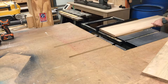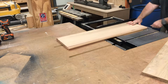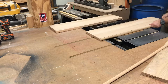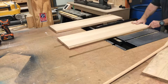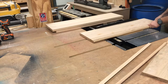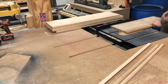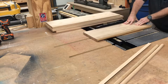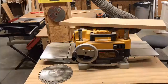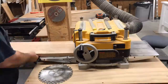We're making this table out of oak for two reasons. First of all, oak is very strong and will hold up well as a tabletop. Secondly, I have oak. What I'm using is some oak stair treads. First of all, I've got to rip the bullnose off the front — we need a square edge on it. These treads were unusable for stairs because they had cuts and blemishes in the surface, but they'll be fine for our use. I'm running them through the planer to take off all those imperfections.